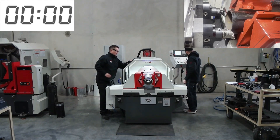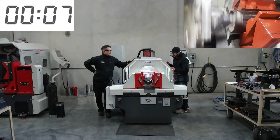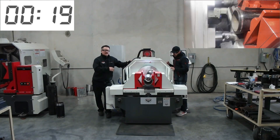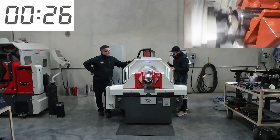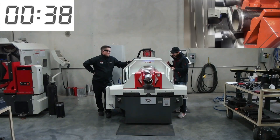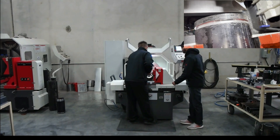As you can see he is just using the blade of the cut groove tool to reference the material. Now for cut groove we are only using one tool — the other tool is just in place to keep it clean. Now if we needed to we could face the end of the pipe, chamfer it, but we just program the cut groove. We can do anything you need. We can cut this cut groove down to the thousands for accuracy. So there is our cut groove.